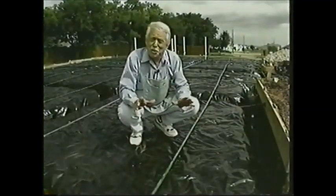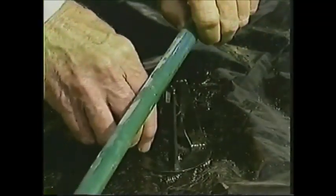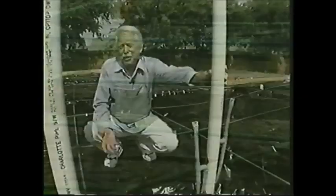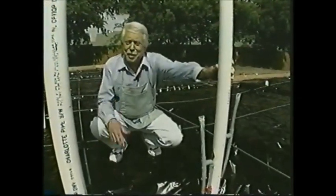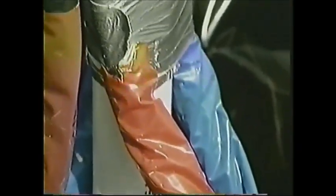For the cable to do its thing, it's got to be in the middle of the concrete slab. So we use these little chairs to raise it up. The pour lets the concrete go all around. The plastic that's over this entire bed of sand is here because you don't want any moisture to rise up and cause your concrete slab to sweat. Also, you notice that the pipes are wrapped so that it prevents the concrete from being able to corrode the pipes and cause leaks.